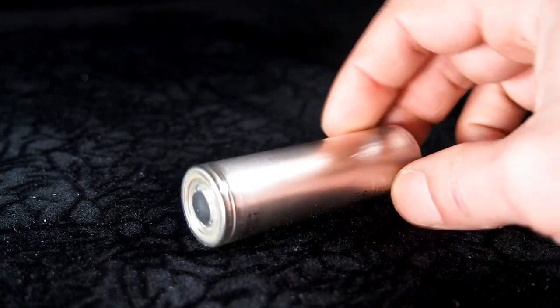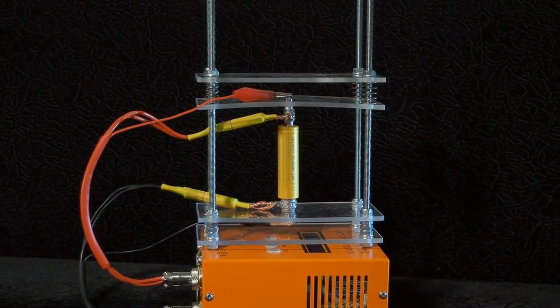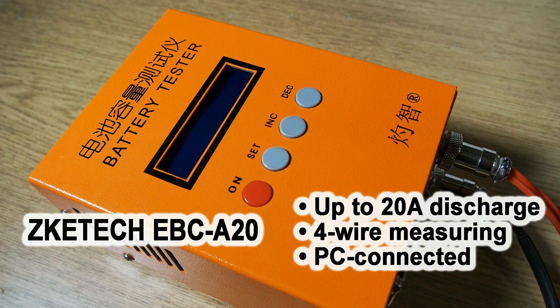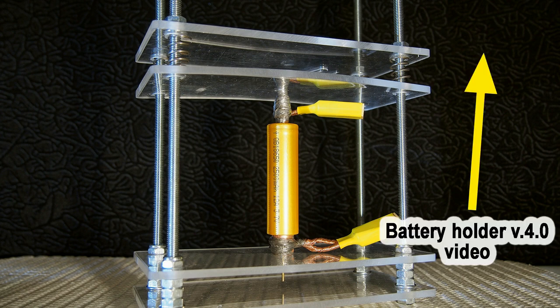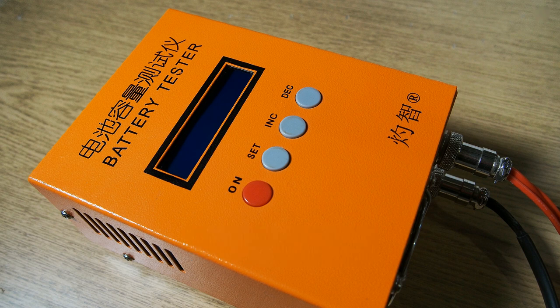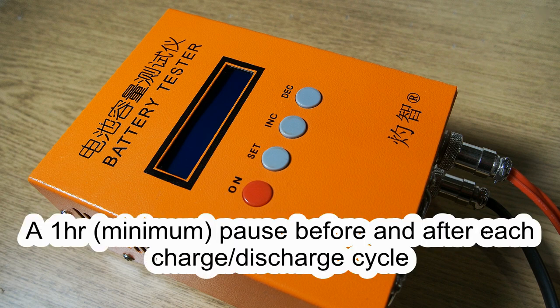Now let me remind you about my testing equipment. My battery tests are done using a special battery tester, the ZKE-TEK EBC-A20, which can discharge at up to 20A and supports 4-wire measurement and PC connection for building graphs. My upgraded battery holder now has version number 4, and detailed information about it you can find in another video on my channel. I've followed all the prescriptions of the IEC61960 standard concerning battery capacity measurement. The ambient temperature was 20–25°C and the battery was charged only at the standard charging current mentioned in its datasheet. Before and after each charge or discharge, a minimum 1-hour pause was held, which is required by the standard.